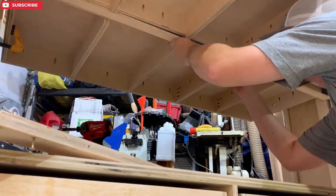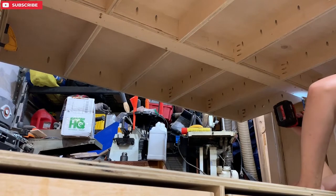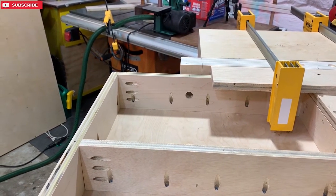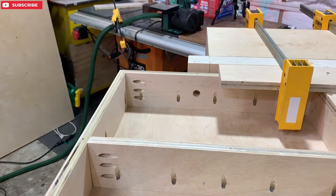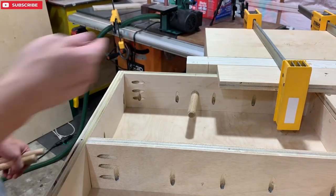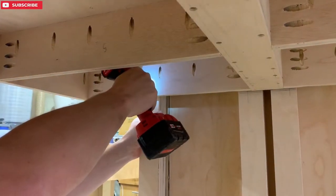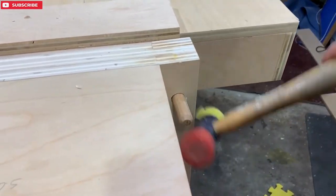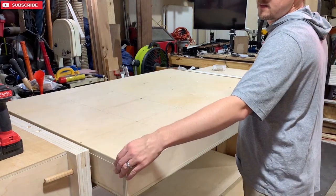Now I'm putting the tunnel piece back on. I locked the top into place — I screwed a screw right through the center section up here and then clamped it to the side cabinet. Do you remember before we drilled a hole in the same place on each side? I need to transfer this hole into it and make sure it's even on both sides. You could actually just transfer the center of that hole into your leg assembly there, move the top out of the way, and then drill your hole through. It'd be a little bit easier than trying to make it all the way through. Once you get that done, you flip it over and get that top on.